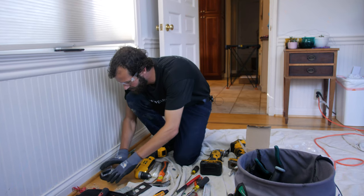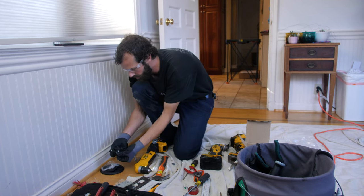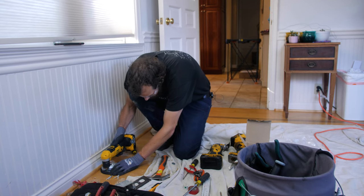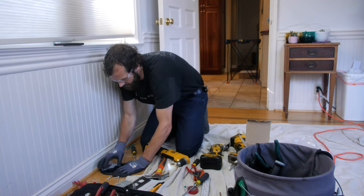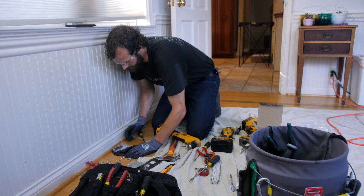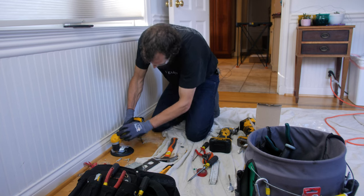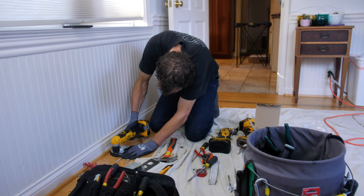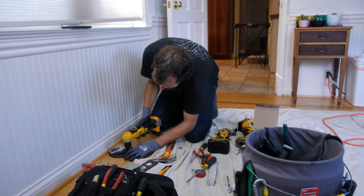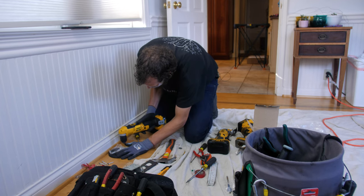All right, we're going to pilot through the hole now for the mounting screws. We've got a total of 4 screws with colored heads. I like the orientation. I've got it flipping up like that with the flap towards the wall. It looks square. Careful not to plunge too far and scar the face of my plate, my cover, with my drill. Interpose my finger between.